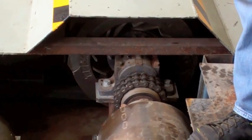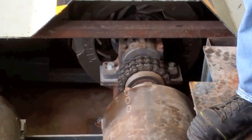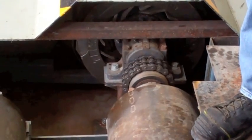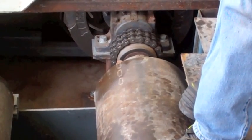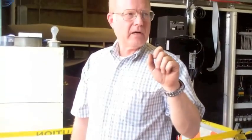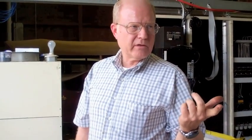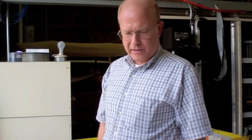True horsepower is torque times RPM divided by 5252, and the computer works that calculation. But it keeps the torque and the speed as separate information, so you can see that on the chart. Now remember, that torque has been amplified by the speed reducer in your differential. So to get the engine torque, you need to divide by the rear end ratio, usually about 3, almost 4, 4.3 to 4.7. So if that says 200, it's about 50 in your case.